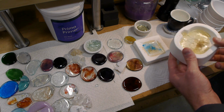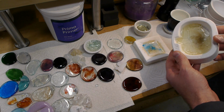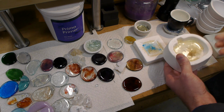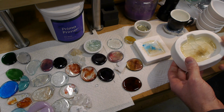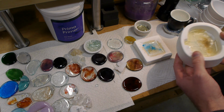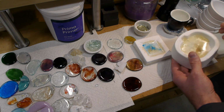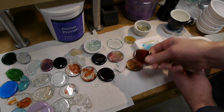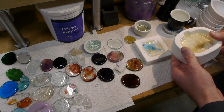There's only one material on Earth that won't stick to melting glass or forming glass, and that's platinum. And so they actually make tiny little platinum crucibles for doing laboratory glass analysis, but that's a little expensive, and apparently, from what I've heard, even then, the glass doesn't just fall out. I mean, it still sticks in there, and so if you're hoping to make a nice, good-looking puck of glass, it's not going to work forming it in a mold like this.